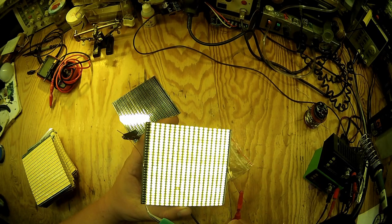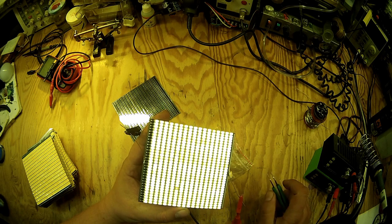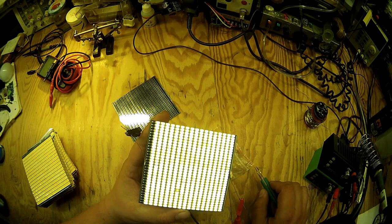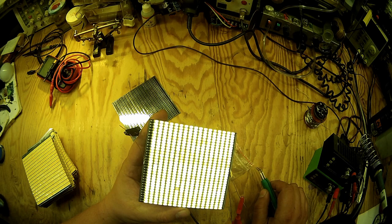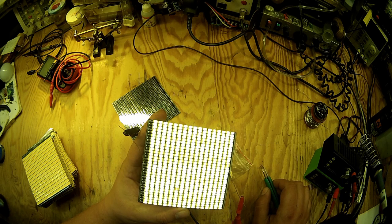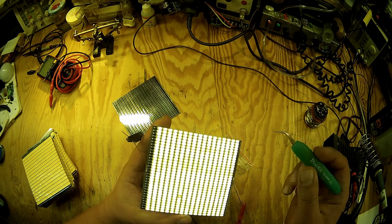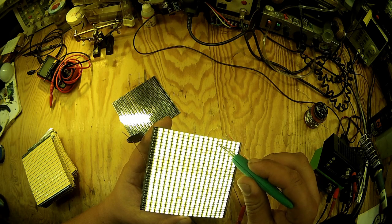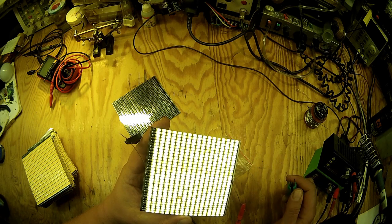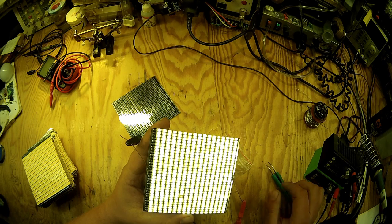The resistors in the series lines are 10 ohms, which turned out to be a good choice of value, because the currents in those series rows are quite well balanced, no more than 20% difference in current. The current could be different, because some LEDs could have a lower forward voltage than the LEDs in the next row, so the resistors help with sharing the current between the LEDs.